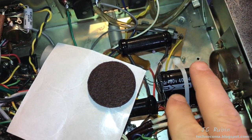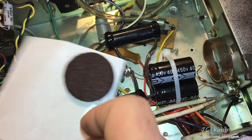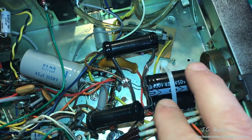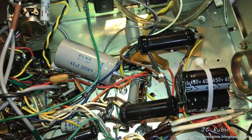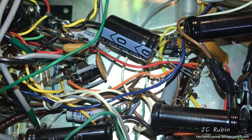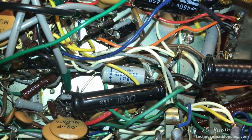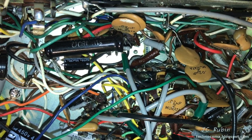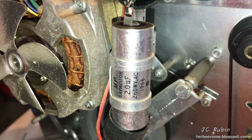The capacitors are solid — you'd have to rip them up to get them to move. Placement looks really nice; I just need to insulate the exposed areas. That's the fourth 40µF in place, concluding the 40µF caps. I've also got a 50µF to do down there and one more on the other side. Last cap in — moving this unit out of the way to replace the single capacitor on the top unit. It would have looked nicer with heat-shrink but Super 88 tape will suffice.